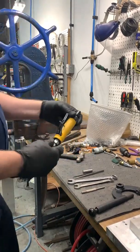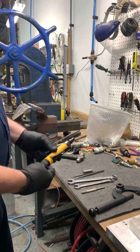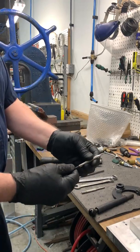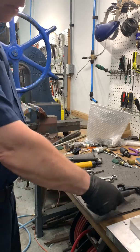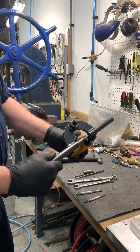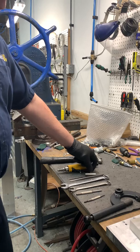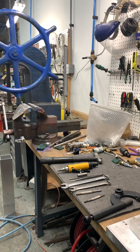Okay, today we will be rebuilding the LSF S250-2, and the tools I have to do it are a hammer, a set of Atlas Copco punches, which are very useful. They have this slider piece on them, 2 different punches. I have the spanner wrench that locks on top of the collet. I have a 9/16, 11/16, a pair of tweezers, and a mandrel for pushing the bearings in a press.